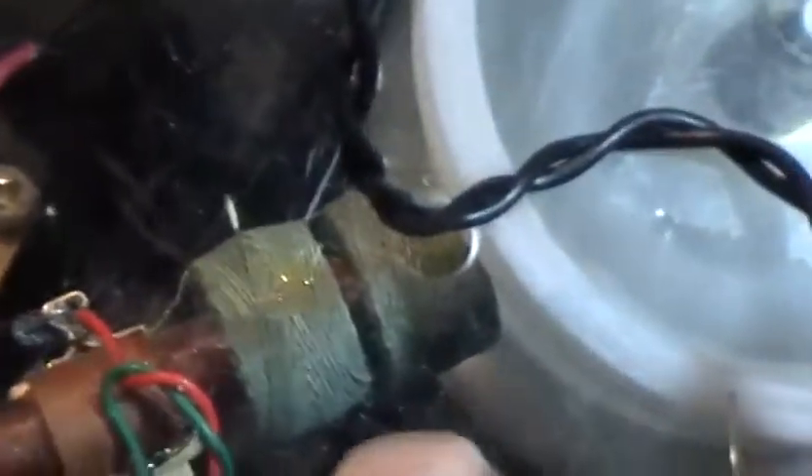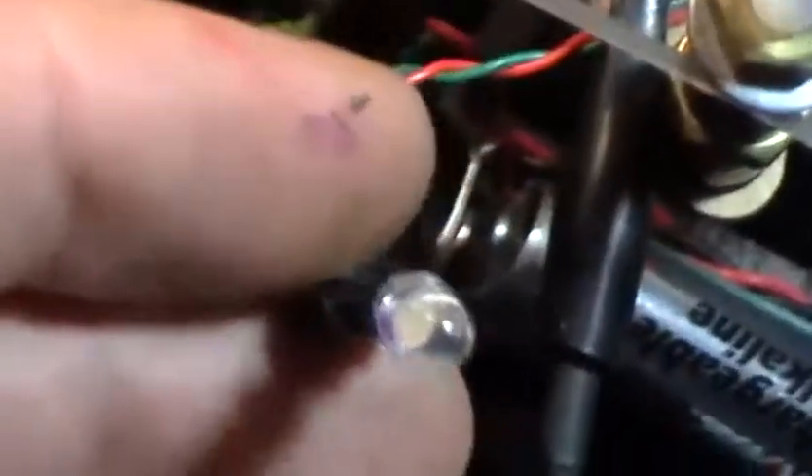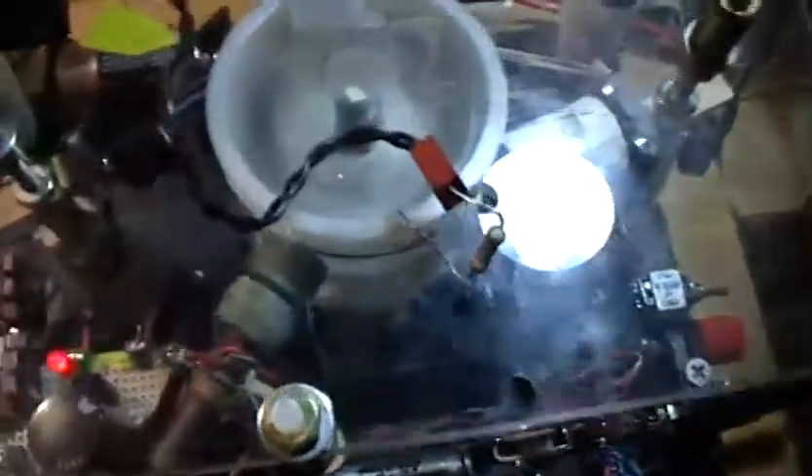I've replaced that big old clunky air core coil that I used in the last video as a generator coil. I've replaced that with a type of variable inductor known as a loop stick. You can see it's got a double wound set of coils, with a red and green wire hooked up to it, connected directly to this LED. I have the scope probes hooked across the terminals of that loop stick, positioned where a generator coil would be if this were an orbo.